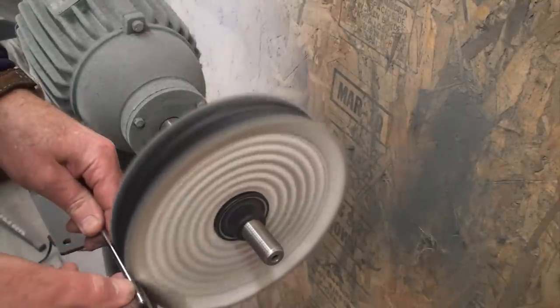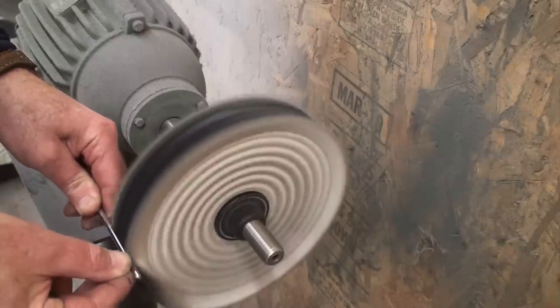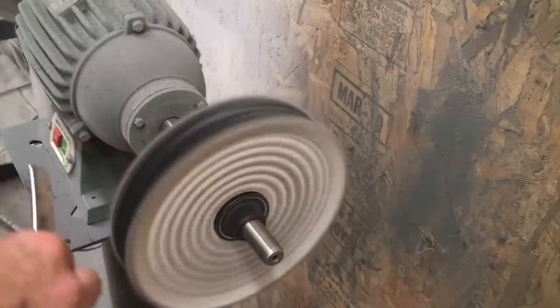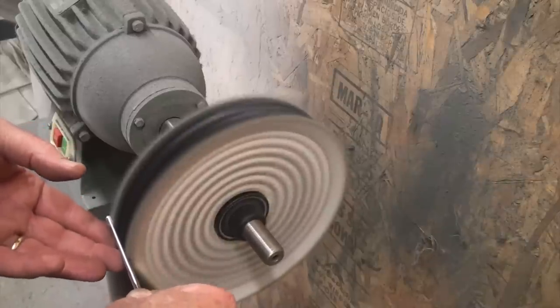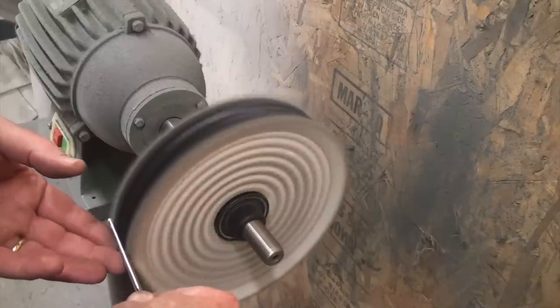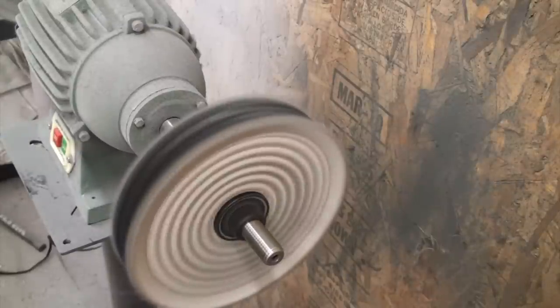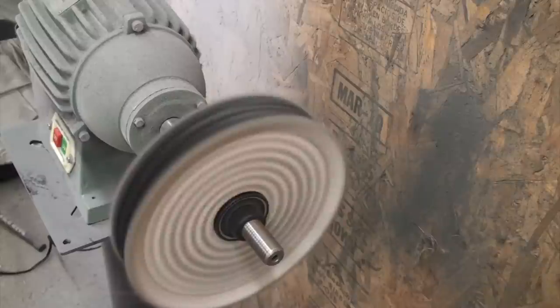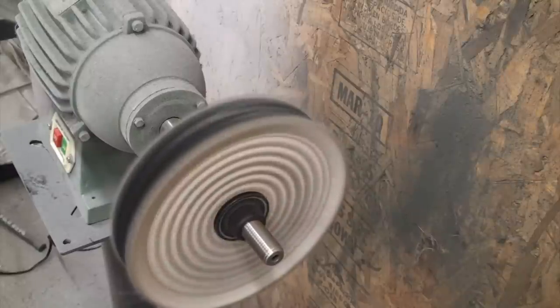Here's the horizontal stroke. It gets a lot of time in there before it's getting really hot. The main thing is you just want to keep it flat, and if anything on here I'll angle more towards the edge so that it doesn't grab the spine. See where we're starting to get? So then we take the razor. Some of them are nice and simple like this when you just have tarnish on them. We'll hone this one before you leave so you can actually test shave it before you leave. Amazing how well that cleaned up.